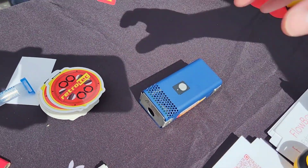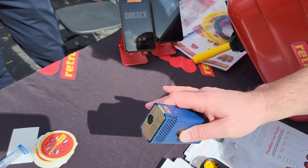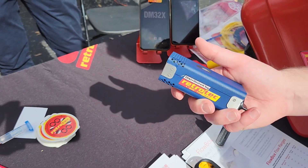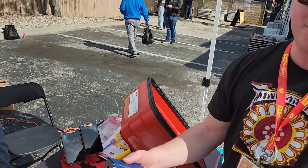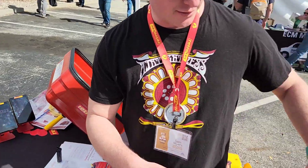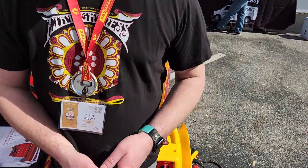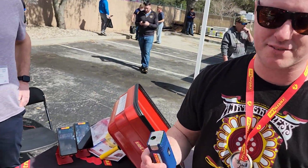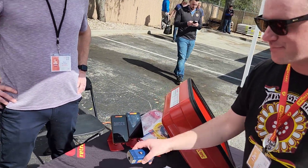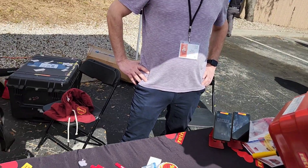The smoker — it's not a new product but it's a very helpful one. It's another tool to make air leaks visible. If we're pressurizing a house with a blower door and shut a bedroom door, we can see smoke shooting up under the undercut and know we've got leaks in that room. It's really good to do in front of homeowners — it helps the light bulb go off.